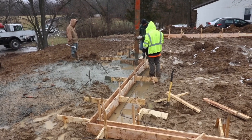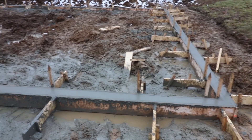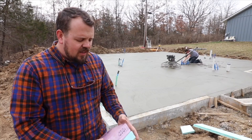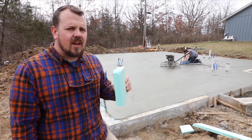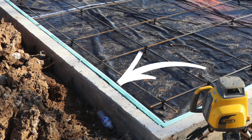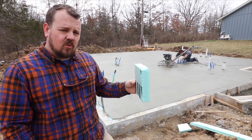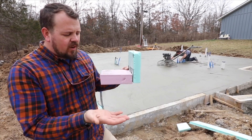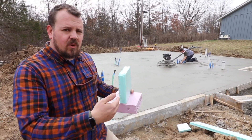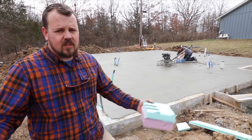What we've done here to mitigate that is we poured that trench footing, and then our concrete guys poured a curb basically around the perimeter. That was formed with two-by-tens, it's four inches wide, and then on the inside of that curb we added an inch and a half of XPS foam on the vertical. And then on the flat, at the four-inch point moving down, we added a two-inch XPS. That allows us to have insulation on the horizontal and insulation underneath. We're now insulated from the ground — thermally uncoupled from the ground — and insulated from the perimeter, which means we're thermally uncoupled from the exterior air, exterior temperatures, snow, or whatever is up against it.